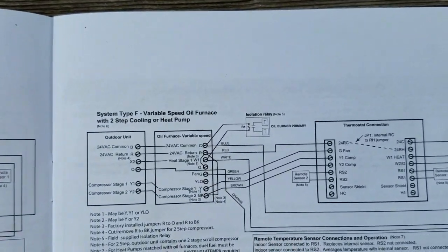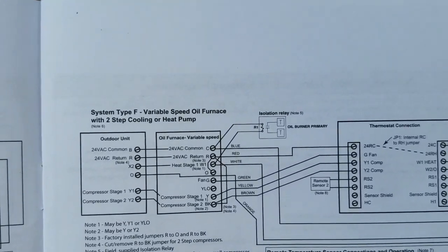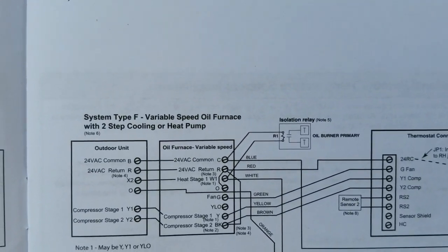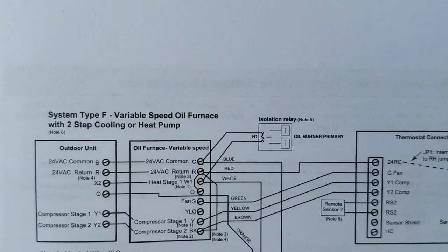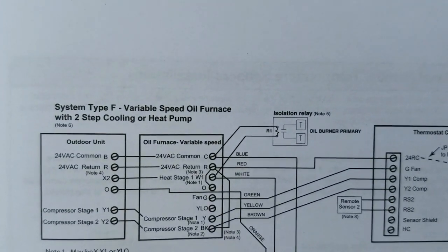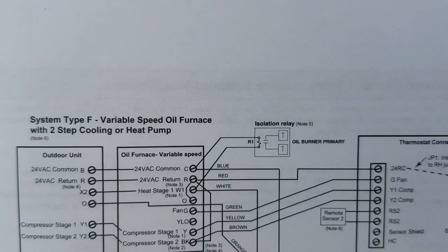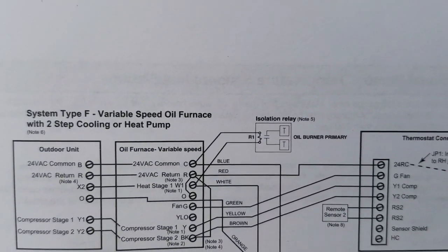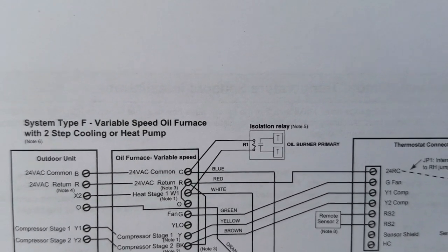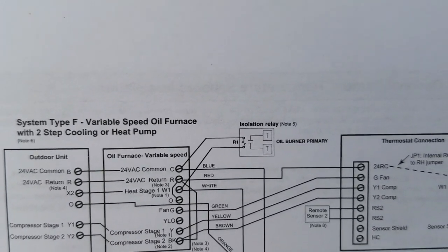It's very important that when connecting to the fireman's switch on your Pentair heater, you use an isolation relay to ensure that no voltage ends up on those contacts going to your fireman's switch. You get a basic 24 volt AC relay with isolated contacts and just strap that across the isolated relay you're using to turn the heater on and off via Z-Wave.